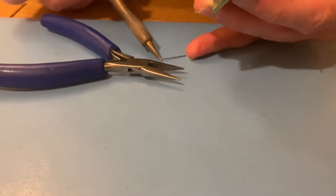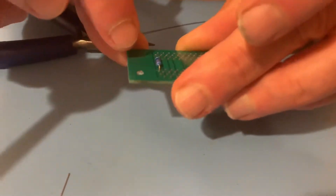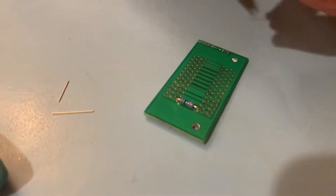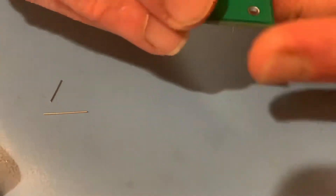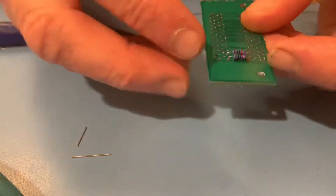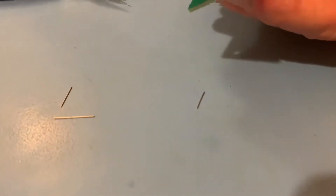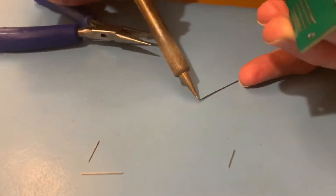Put a little bit of flux on there, tin your iron — which is always the most important thing — then just tap one leg and that holds it in position, so you can do another one next to it. Try and keep the bands in the same sort of sequence. Form it again, body in the middle. Try and keep the colors at the same ends — that way if you're checking it or an inspector's checking it, it's much easier to read them all in one line. Hold it down with your finger, turn it over, crop the legs to about one millimeter. Add a tiny bit of flux — solder already has flux in it but I always like to add a little bit more, it just helps the joint go so much easier.